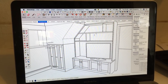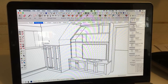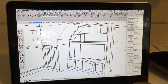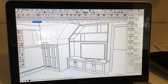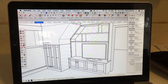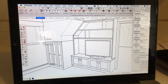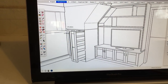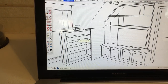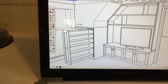This is the job in question — a bespoke display storage unit. There's a sort of bulkhead that sticks out into the room with the stairs going above it from the hallway around to the side. Under there, which was a very low ceiling height and very deep space, we came up with a solution of having some pullouts — similar to what you might do under stairs but without the angle. They're about 900 millimetres deep and will be bookshelves and CD shelves, so when loaded up they could be very heavy.